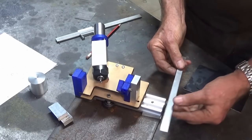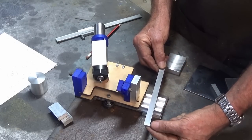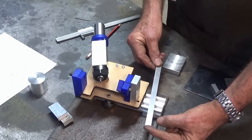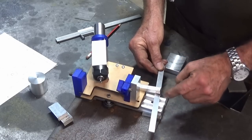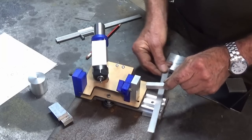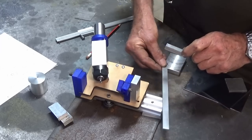So there will be this long piece of aluminium here. It's going to be fixed on a pillar at this point so that it can rotate around this central axis point here. And then there'll be a short connecting rod that joins the lever to the carriage, so that when you're grinding drill bits, you don't need to grab the carriage. You can just grab that handle and pivot that.